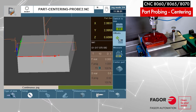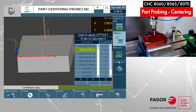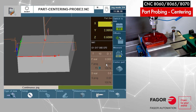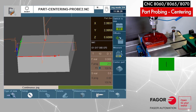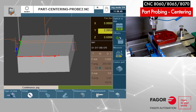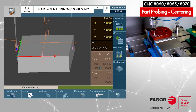We can review the offsets — G55 shows new numbers. Select, then press cycle start to activate. G55 is activated. We can test it by going to X zero. When you finish the cycle the feed rate is very low for safety, so if you're jogging at that feed rate it's going to be slow. What we need is to activate higher feed rates by pressing F — 100, 200. Cycle start. Move to X zero, cycle start. Move to Y zero, cycle start. That's my zero-zero point of this part — at this moment we're ready for production.